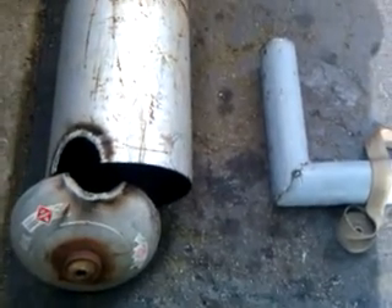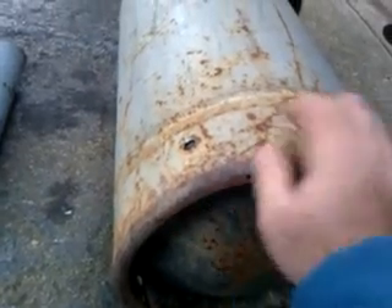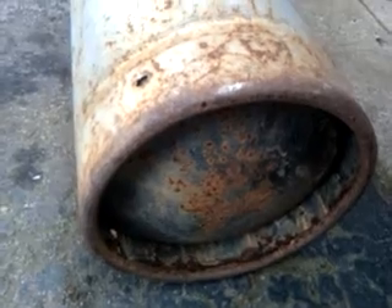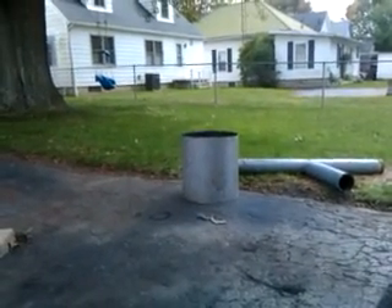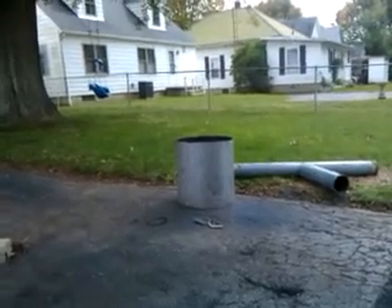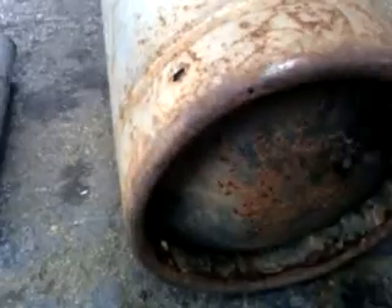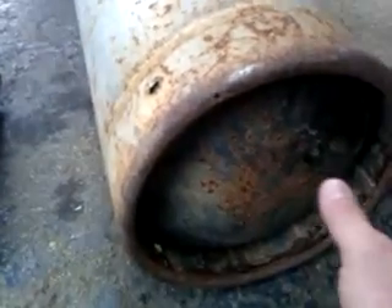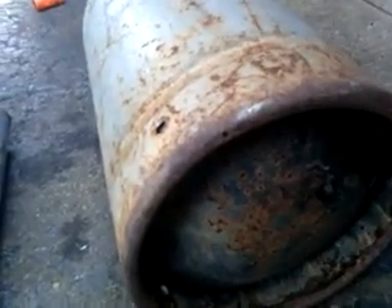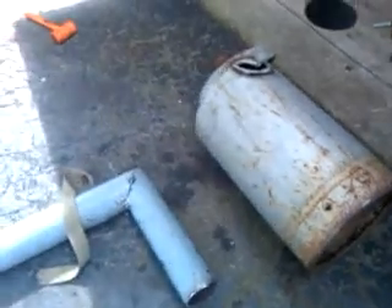On the top, I've seen a lot of people cutting this ring off right here, knocking the little welds off all the way around. I think I'm going to leave it on. The piece I cut off — basically the middle of the propane tank — I'm going to split it in half, flatten it out, trim it to fit around here, and make a flat spot, like a double layer, flat on top in case I need to cook on it in an emergency.